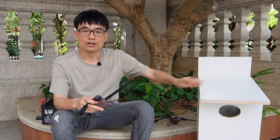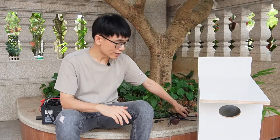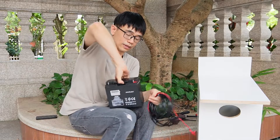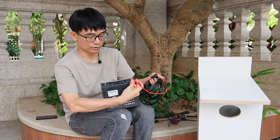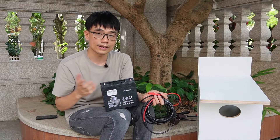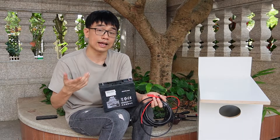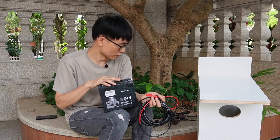Later we will install the camera inside and place this receiver to connect to the router and watch the live video on the mobile phone. One issue is that when the box is placed outside, there is no power source — how do we solve this? We are going to use this motorcycle battery. The cable connects to the two terminals to get DC power from here and connect to the camera. This is a 20Ah battery, which will supply about four or five days before we need to recharge or swap the battery. If we use a larger one, like 40Ah, you may get about 10 days.